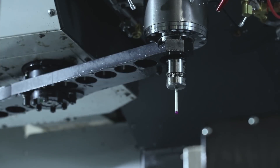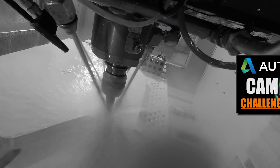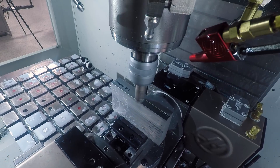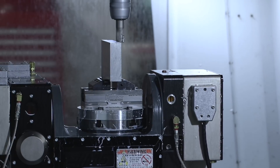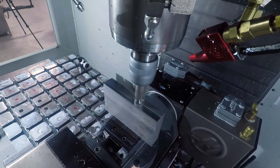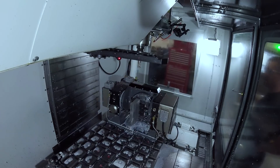We're starting off with our one-inch Coralloy Pro X ripper end mill. We've had a lot of luck with this — in fact we used it making the giant A for the Autodesk CAM challenge project. Here we're running it without coolant mostly for video purposes, but because it's a through-coolant tool we can actually use our Haas's through-coolant air, which helps get chips out for filming. With aluminum you want to avoid getting it too hot because it can turn gummy and weld up. You can see it's just that easy — we're rotating the part around on this 3+2 tool pass to deck this part down.